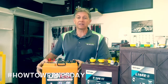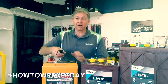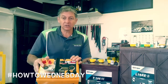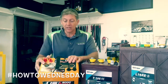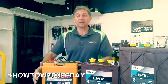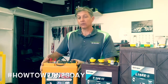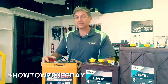This is produced by US Battery — it's an AGM 2000. She has 210 amp hours. She's very heavy, probably almost 70 pounds, and it's completely maintenance free. It does have caps on here as you can see, but they've been injected with the electrolyte and then glued shut, so you never get into the caps. AGM stands for absorbed glass mat. This battery is superior in chemistry to the wet lead acid batteries in the fact that internally we have less resistance. It'll come up with charge quicker, it'll discharge slower, and it will not produce any dangerous gas.